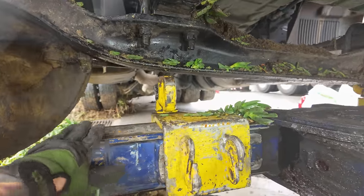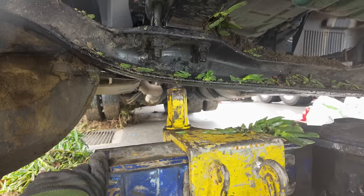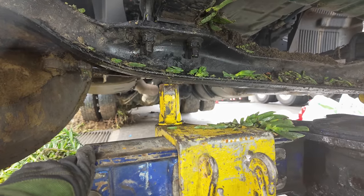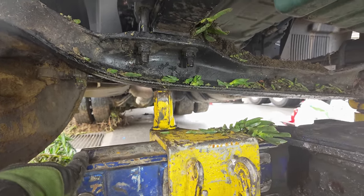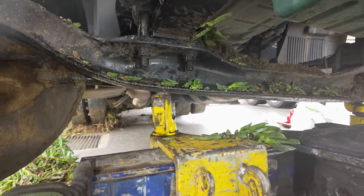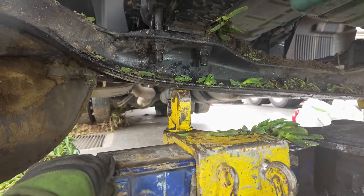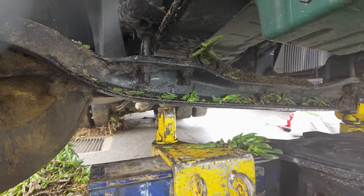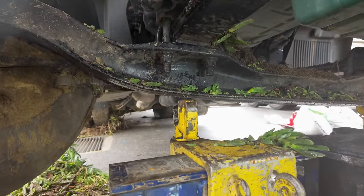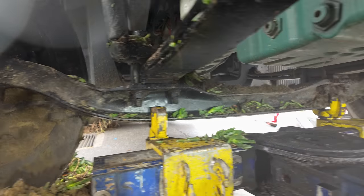Okay, now retract the underlift. Go in with it, tuck it in. Now tilt up. Retract until... Retract with the underlift. Good. Now, underlift tilt up. If I tilt up, it's going to extend. Then let out with this cable only. There you go, more. You got it.